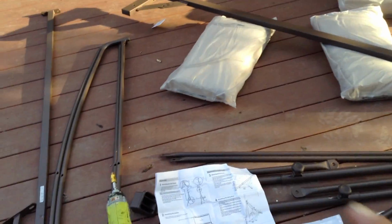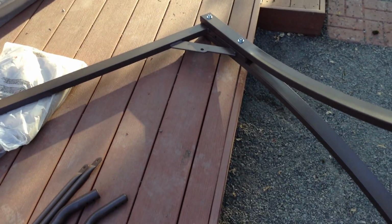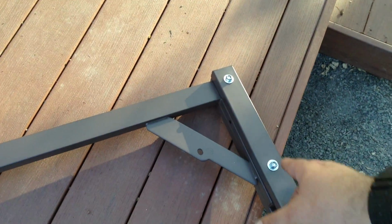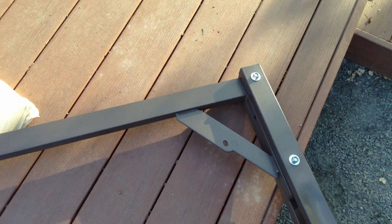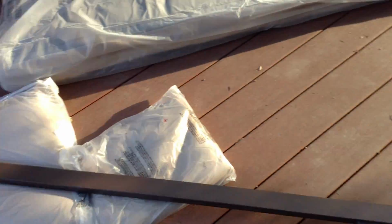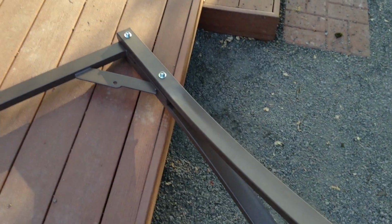So that's your main cross beam, which is actually welded, and then we're making a sandwich with the bolts, so this actually becomes a pretty reinforced area. The other thing is, check your bolt hole positioning and all of that so you don't get something reversed here.